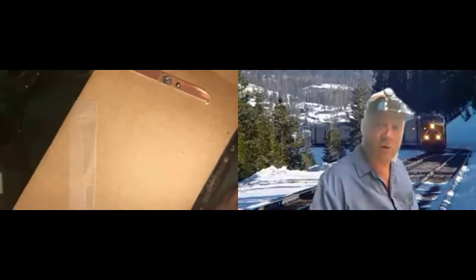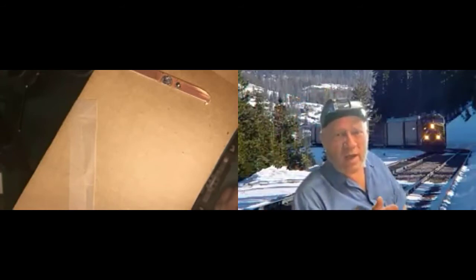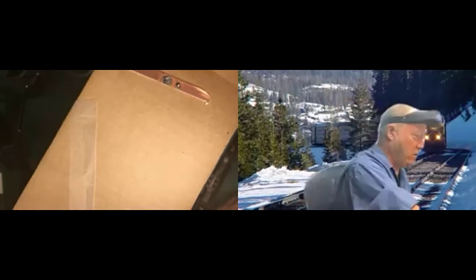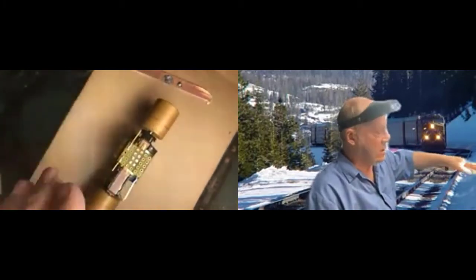Now, it should be remarked, this comes from years back working for Hewlett Packard when I was a line tech back in the 80s. Rework makes rework. You don't want to rework as a habit because your rework may cause new solder bridges. It may cause a component that was heated during the initial soldering to fail during your rework. So yes, you can do it, but you don't want the rework to be a habit. It's not, "Aw, doggone it, there was one I didn't get right, I'll go back and fix it." In general, you want to get it right the first time because soldering is not something you can keep doing.